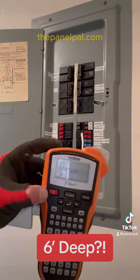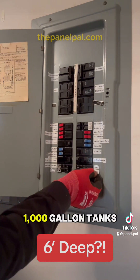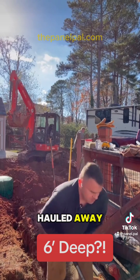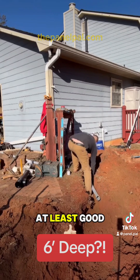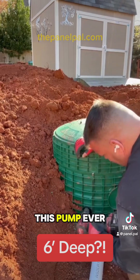Another thing to consider when talking about burial depth is all the backfill. We had two 1,000-gallon tanks installed here, and all the soil that was removed is not getting hauled away — it's getting put right back where it came from and graded out, which is going to bring the grade up several inches at least.